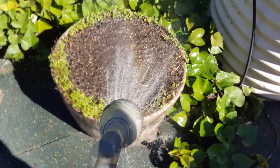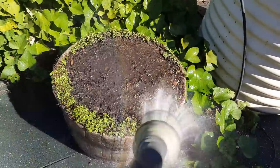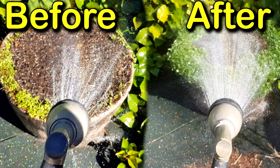To prove how well this worked, I conducted a very scientific experiment — I called it the oregano test. Watch now as I show you the before sprayer head operation that was starting to drive me nuts over several weeks, and now the after sprayer operation when I finally got around to soaking the sprayer in CLR, thus improving the water flow overall. Pretty cool, hey? I know it's really basic, but it does work and it could just save you from having to pull the thing completely apart.